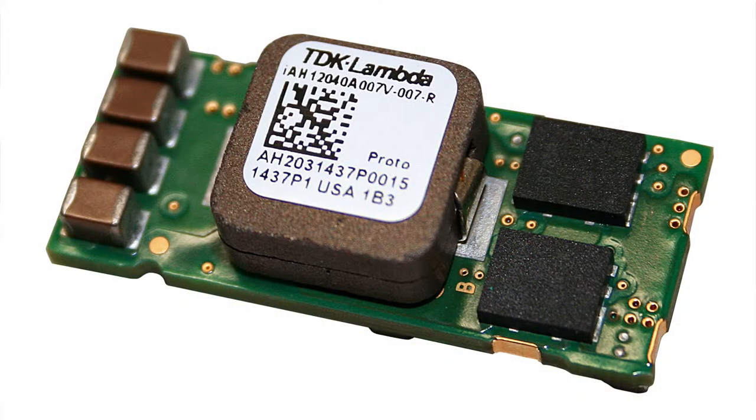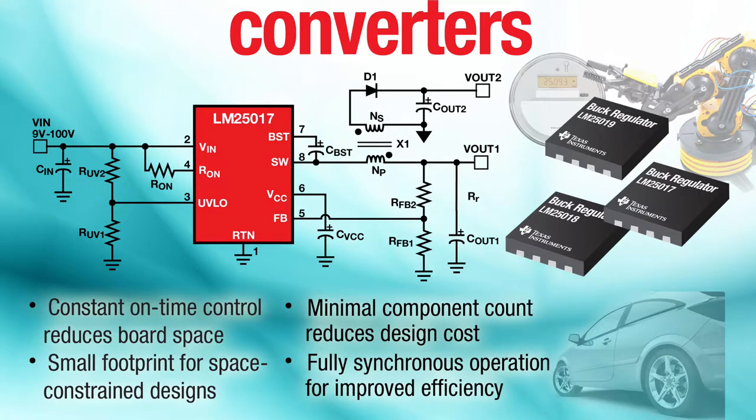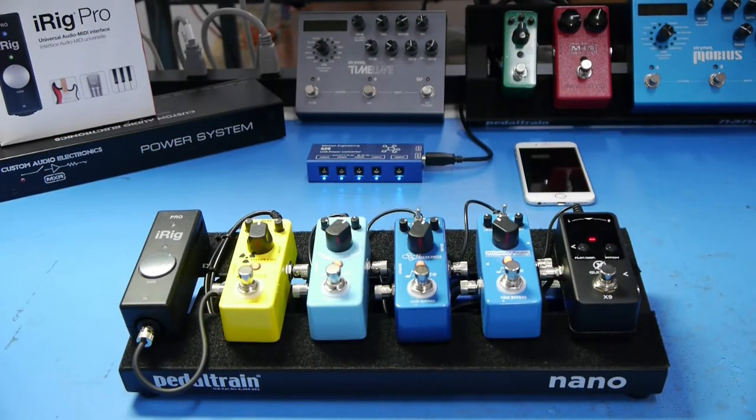A key mechanism of how these work is by switching current flow on and off quite quickly using transistors. By controlling the on and off times, called the duty cycle, the switching converters can easily convert between voltages. The trade-off is that now we're no longer just providing a continuous current flow in one direction, but a switching current on and off through inductors.